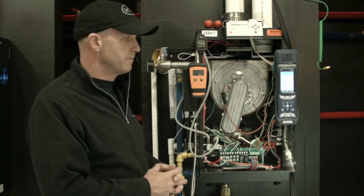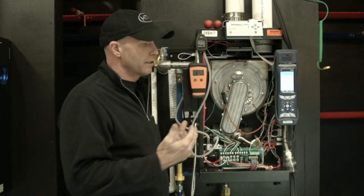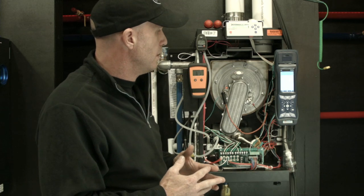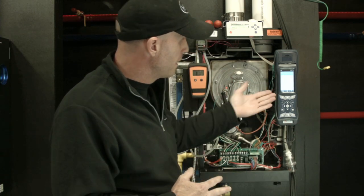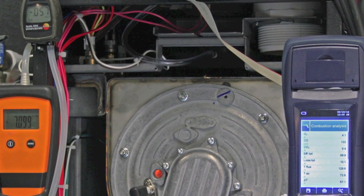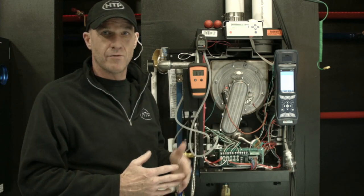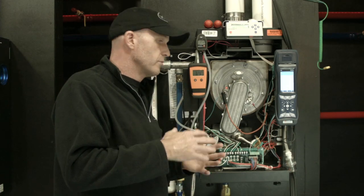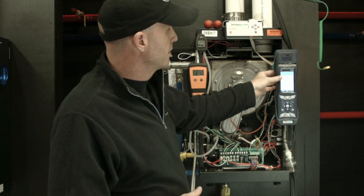I'm going to see if I can get that to come up just a little bit. Depending on the analyzer, it can take more or less time — you definitely want a good place to get rid of the heat since you may need to keep this on for 15 to 20 minutes or even a little longer. I've made some good adjustments: CO2 is up to about 9.3–9.4% and CO is well within range. On the throttle screw — internal variable orifice — counterclockwise allows more fuel through the valve, raising combustion levels. If I need levels to go down, I go clockwise to close that orifice. Sitting at about 120 ppm and 9.4–9.5% CO2, right exactly where I want it to be.